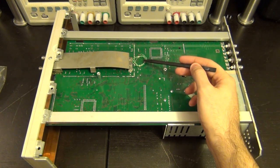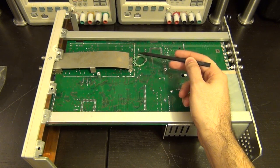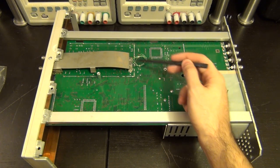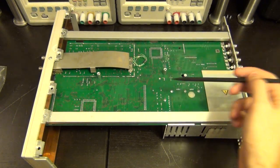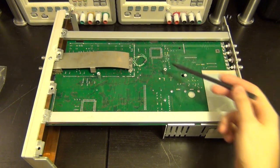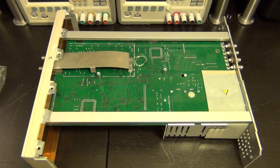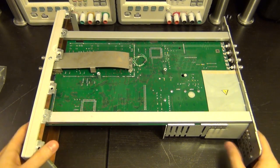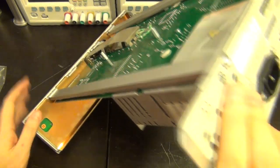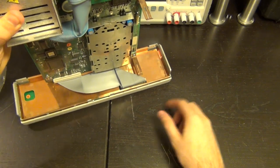There is this interesting cable over here that's looping around with a ferrite core on it. And I see what they're doing. There's two cables coming out and going in on a loop and then going back. That's got to be a delay line, the length for implementing a delay. That's probably what that is. I'm not 100% sure, but that seems reasonable to me. So other than that, looks pretty straightforward. If I look at it this way, nice copper shielding right there in the front, really going out to make sure that this portion of the system is insulated.